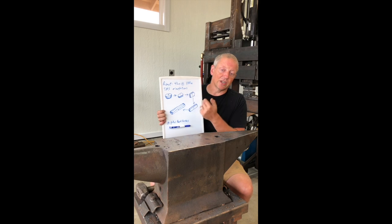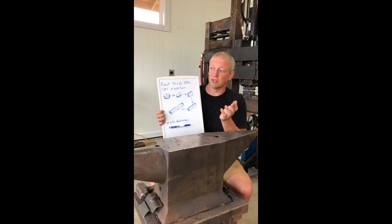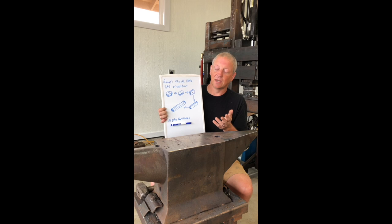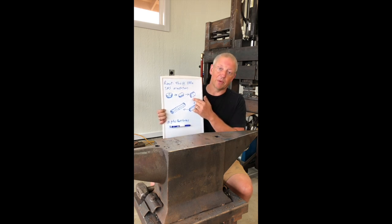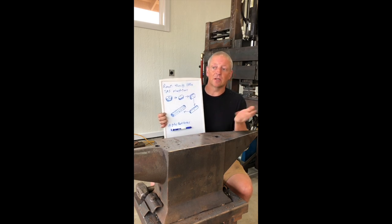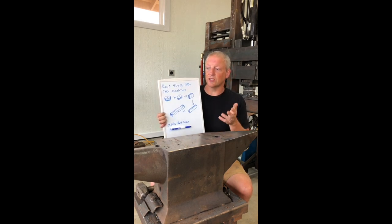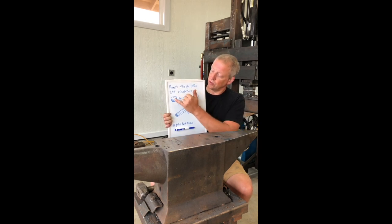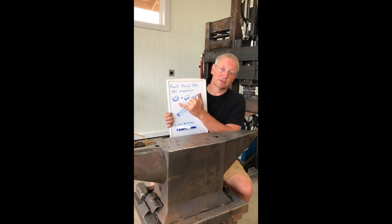This is a very traditional method of forging, and there are good reasons for it. If you're going to be forging a double-edged blade, rather than flipping up on edge here, you would continue with this orientation. You would go with a top as face orientation. Not very historical, but a good orientation that I've used in the past quite a bit. You can also do it so that the top center becomes one end of the bar.